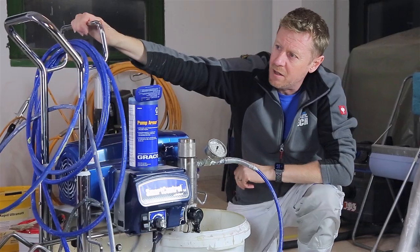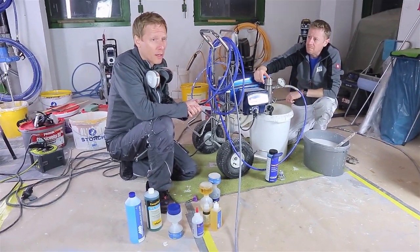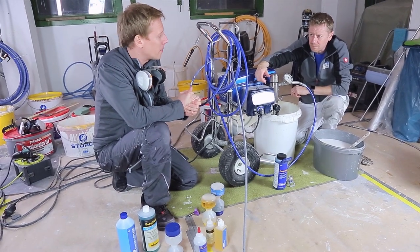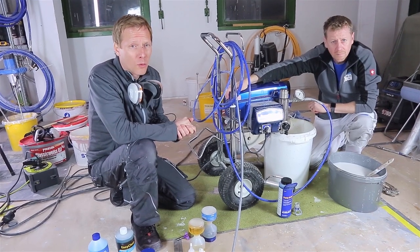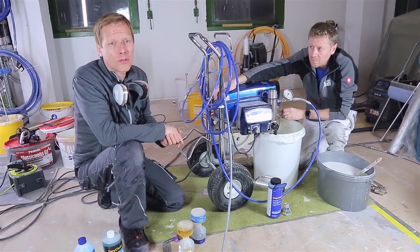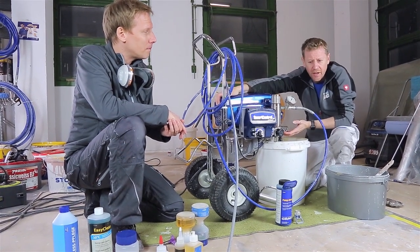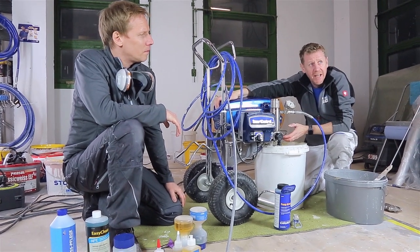Because if you have a problem and bring it to a service center, you were lucky that just the hose was frozen. Every year in the winter we have customers coming in with broken pumps - in Germany the temperature conditions are often more severe than in the UK, and it happens that people don't think of it and just leave the machine in the van without heating. The liquids in the pump freeze and just break the pump. We've had cases where the packings and the cylinder valves were damaged just from freezing. It's unnecessary and will cost a lot of money - the cost of actually repairing is one aspect, but the cost of losing labour because this machine has no equal on site for the amount of work it gets through - I can't afford that loss. So just this time of year, take extra care.